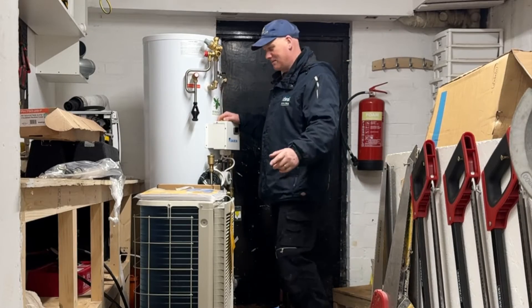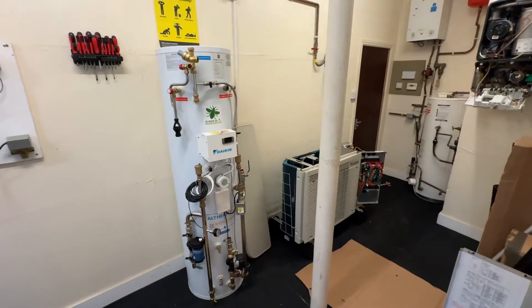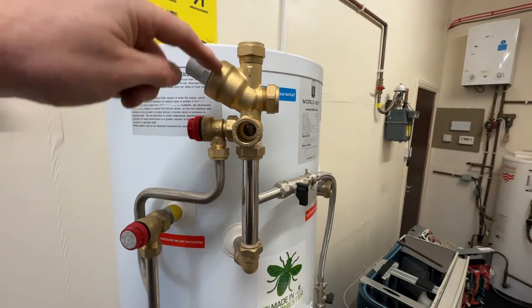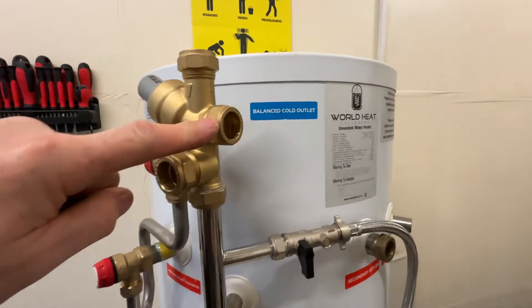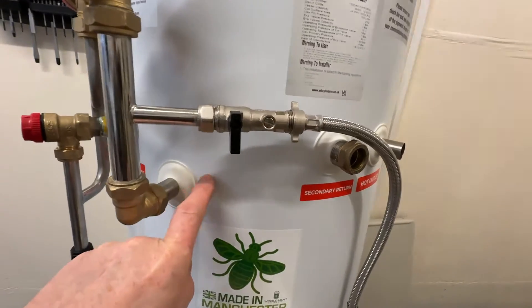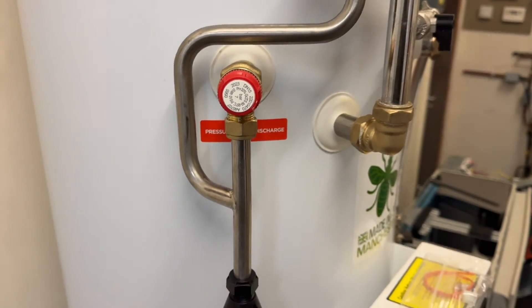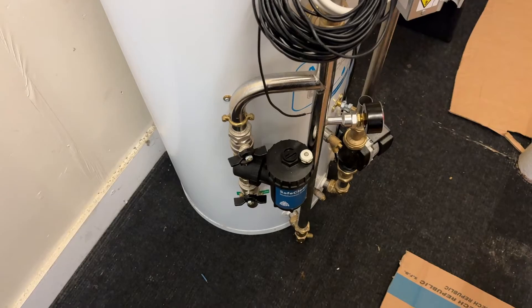Come on, get them in there and get them installed. Now as you can see, we've got the cylinder and the heat pump kind of in position in the classroom. Let's have a quick look at the components. This is an unvented cylinder, so we have a standard combination valve — this is where our cold water comes in, this is where our expansion vessel goes, and this would be the balanced cold. As you can see, the cylinder has everything written on it. This is the second return if we were ever going to put secondary return on it, and this is where our hot outlet comes. We've then got our seven-bar pressure relief valve going to our D1 pipe and then into our tundish, which goes straight through the floor because there is a drain in the cellar.